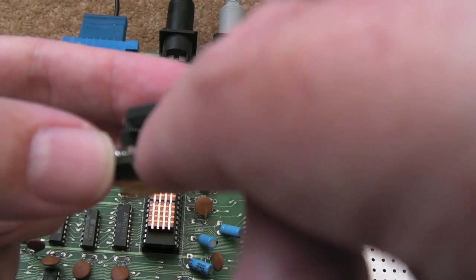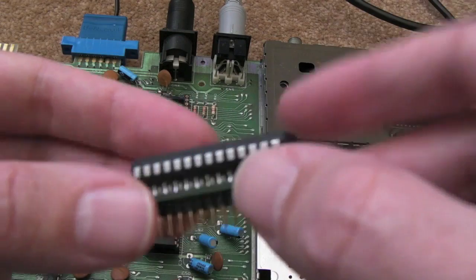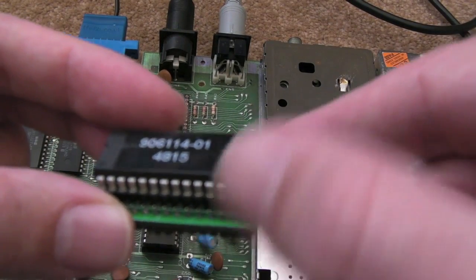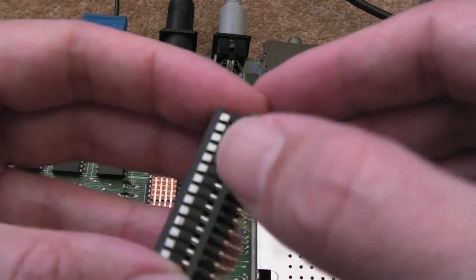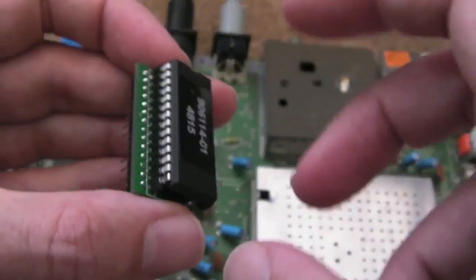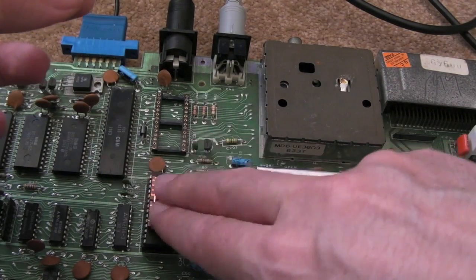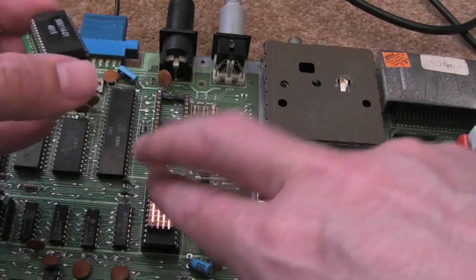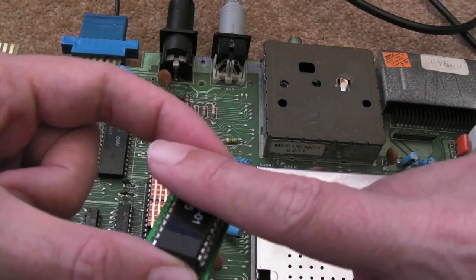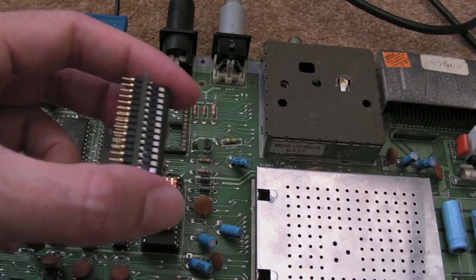You can just about see there's a little SMD cap inside it. I've been tinkering with this a little bit — you can see there's a bit of solder on the edge where I've removed it with solder braid, and the same on the other pin. I had all sorts of problems and I thought it was the PLA, but it wasn't. Long story short: if you're using a nano SwinSID, it appears the nano SwinSID has an issue with these replacement OTP chips. There's a timing thing going on, I think probably with the chip select.